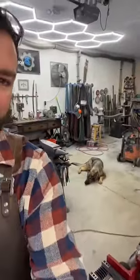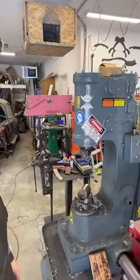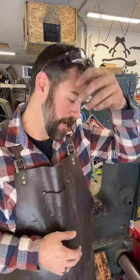All right, I think after this, we're going to go back to the power hammer. That's right, put it right here. Okay, so I got rid of that little indent that I was talking about. Looks nice and solid, so I'm not super worried about that because it's going to end up at the very edge. Usually the edges get ground out anyways because there's usually some sort of inclusion at the edge and the ends. So we cut off the ends, grind down the sides.